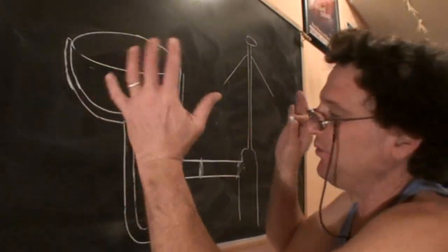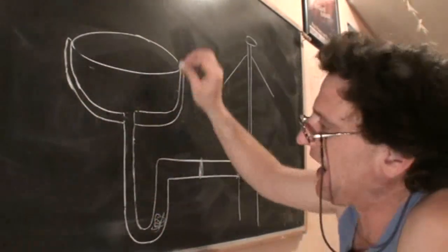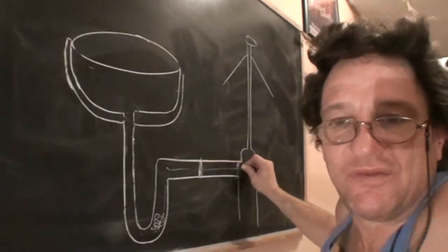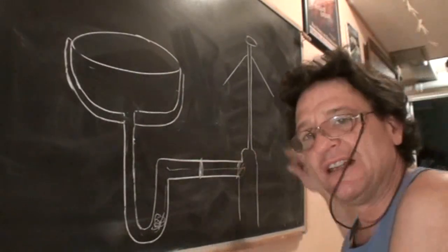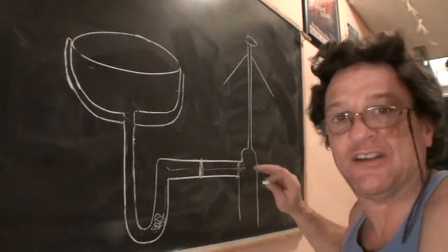So what we're dealing with today is just plungers, which is basically going to get you a plunging action through the trap and a couple of feet down the line. Usually not effective for anything more than a couple of feet past the trap.